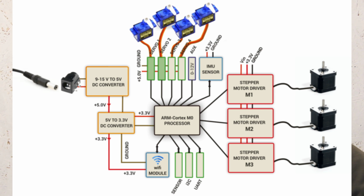It has a customizable button as well. According to the information, we can have it pause the robot or change internal parameters. For example, one of the robots is a balancing robot, which is the first one I'm actually going to make. Maybe we can use the button to change the PID tuning on that accelerometer, for example. So what else has it got? It's also got a reset button, which is pretty standard on an Arduino type board.